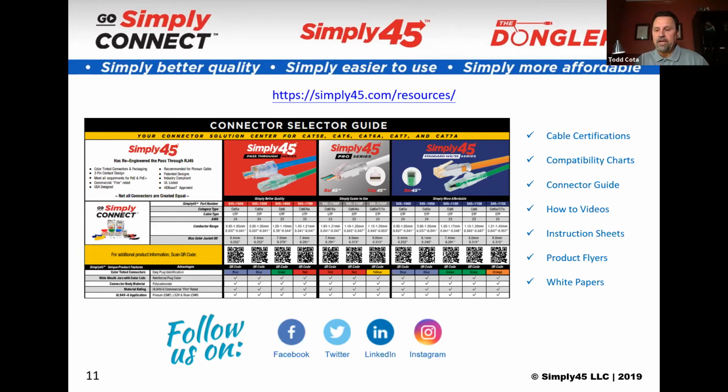That's some of the biggest frustrations we hear out there: just because it says it's a Cat 6 connector or cable doesn't mean a Cat 6 connector is going to fit on it. There are limitations. There are different insulation sizes, and sometimes they cheat on copper sizes and things like that. It really comes down to the size and flexibility of the connector, so you want to try to create a compatibility chart.